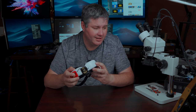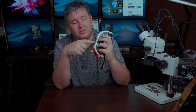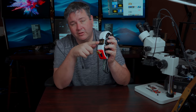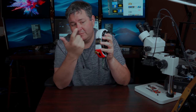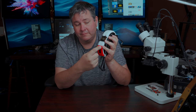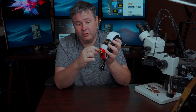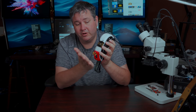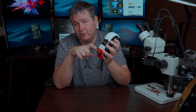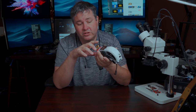Here it is — this is the antenna. Basically, it's this little PCB that you see right here. I use double-sided tape to stick it on there. I know they make 3D printed mounts, but this seems to be the best to me. I use two 45-degree converters, which don't come with it, but what I find is when you plug them directly in, the wire kind of pushes off the side, which is going to put a lot of stress on it when you put it in your bag. So I think it's a pretty good recommendation to use an adapter like this.